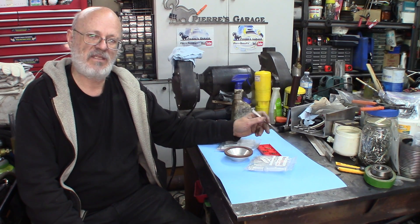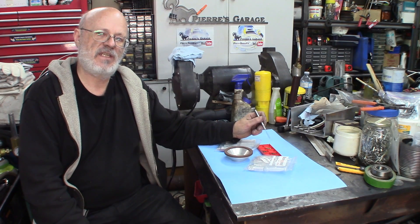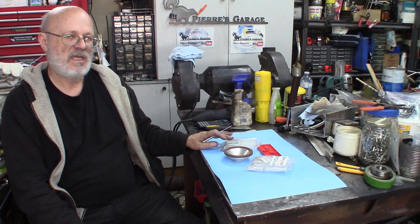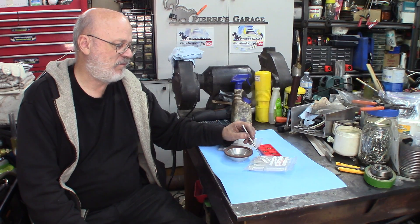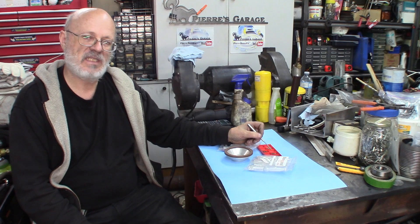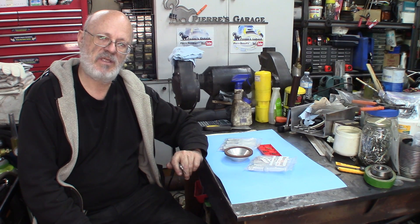Once the surface is kind of flat, you'll be left with some streaks. If it's sufficient for you, then you stop there. I wanted something more like a glossy finish or mirror finish, so I got some kits. This is some diamond lapping compound. The first kit goes from 40 microns to 7 microns — this will give you a pretty smooth, pretty nice finish, starting to be reflective. If you really want the mirror finish, go to the second kit from 5 microns to a quarter of a micron — seven steps. The actual insert you're going to see today is finished at one micron. I could have gone two steps lower, but this is more than what I need and will be good enough for the application.